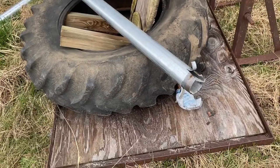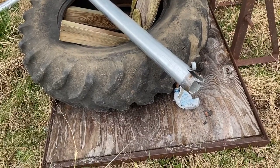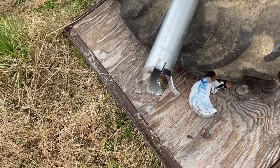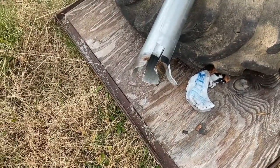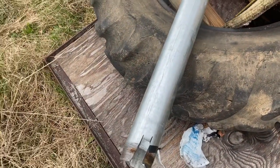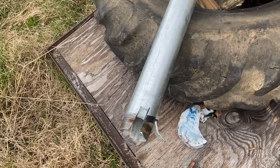If you want to get this material, you can order from hurricanewindpower.com — they can get you all the information when you go to get your panels and stuff like that. What I do when I'm out in the field: one is I cut the bottom and bend those up to make ears on it so that it grips more into the concrete and isn't going to slide right through. Another thing I've done is drill a hole one way and one the other way making a cross, and put one-foot pieces of rebar through that.